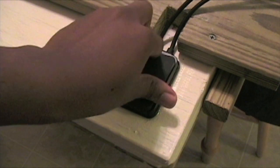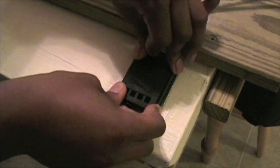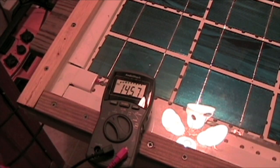I'm going to close it up — I already left it out for a couple of hours — and now I'll go around the edge of the solar panel and secure that with silicone as well. I'll put this back on top here and it's a nice tight fit, which I like. After adding the junction box, I checked the connections and I'm getting close to 18 volts, so I can tell it's hooked up correctly.